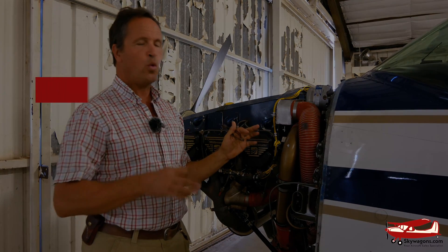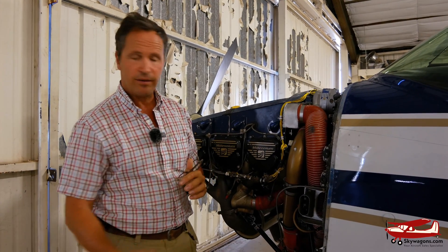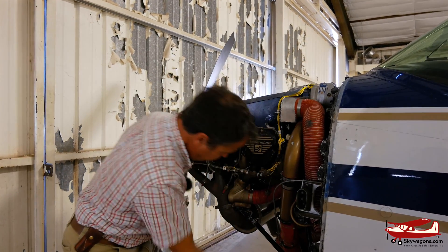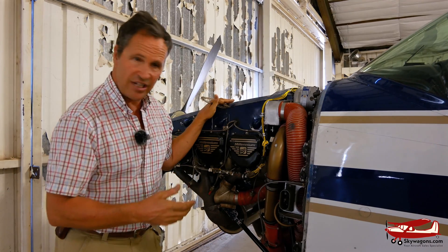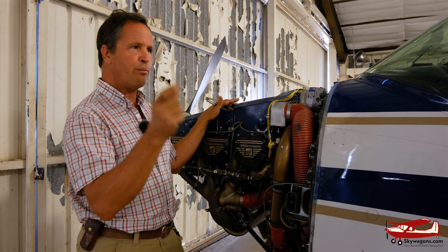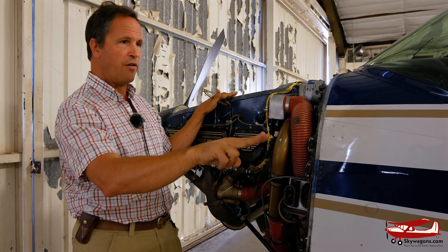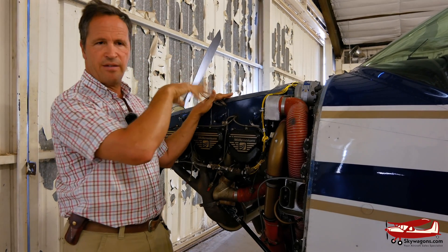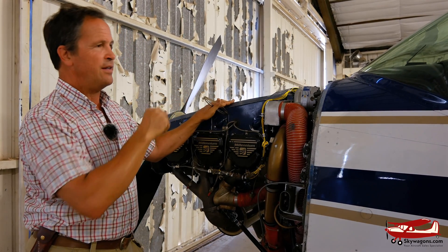This supercharger is made by a company called Forced Air Motive in Colorado. It's about $30,000 and bolts onto the back of a Continental. Air comes in here, into the supercharger, gets compressed, blown back out and into the bottom of the carburetor through normal carburetor induction. This is supercharging a carbureted engine — forced air into the carburetor would cause too lean a mixture without sufficient fuel pressure from the high wing. So there's an added fuel pump; you run two fuel pumps for takeoff. After takeoff, once climbing out, you turn one off and swap pumps every hour or so.